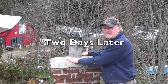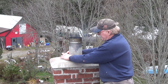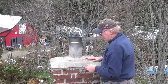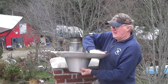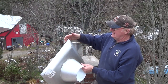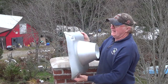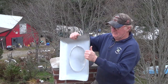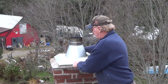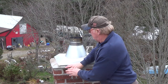The Thermix has hardened up. Basically when I filled it up I just smoothed it out with my hand and let it harden. This was a piece of flat flashing, and all I did was cut the end at an angle, bring the corners together, and rivet them — that way I get this bow that will fit over my chimney. Of course your chimney top may be different so you might have to do something else.